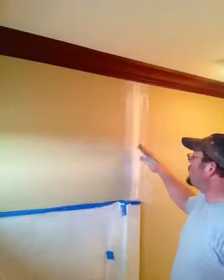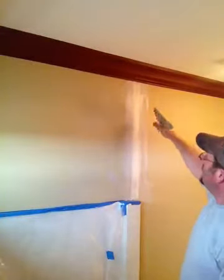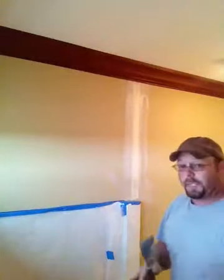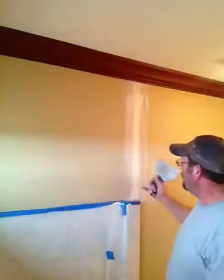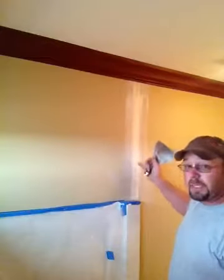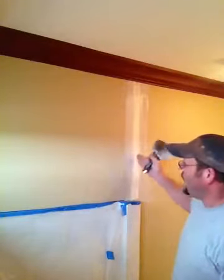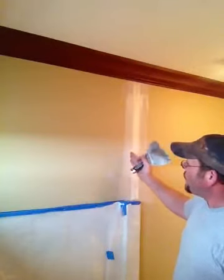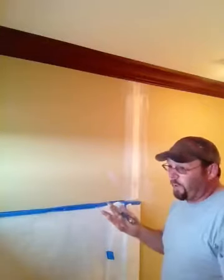Now when that dries, it's actually where this crack is, it's going to suck that tape up in there a little bit. And it'll never crack once I get it floated. I've been doing it 19 years. If I do my cracks like this every time, I've yet to have one crack where I tape it. Now, I have had them come back and crack to the side of it before, if it's in a major stress area, when it's going down a road or something like that.